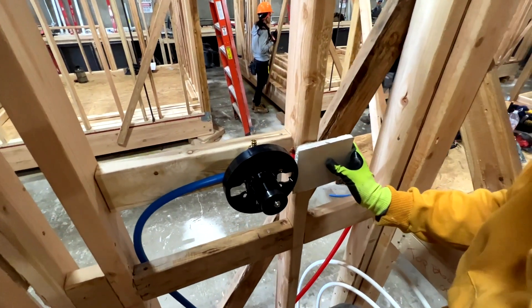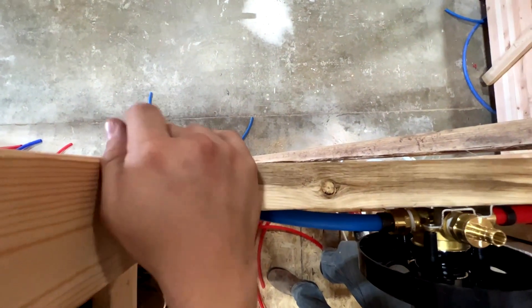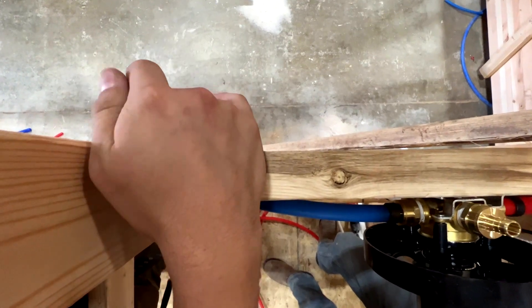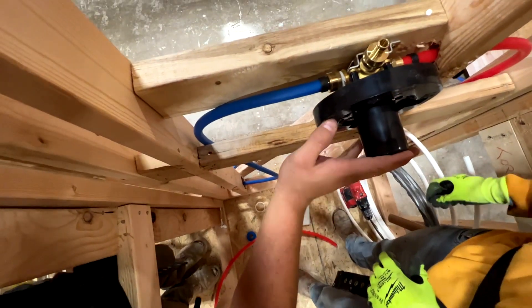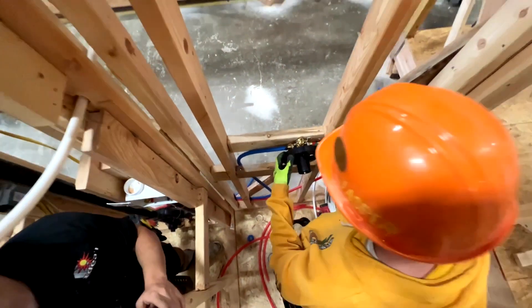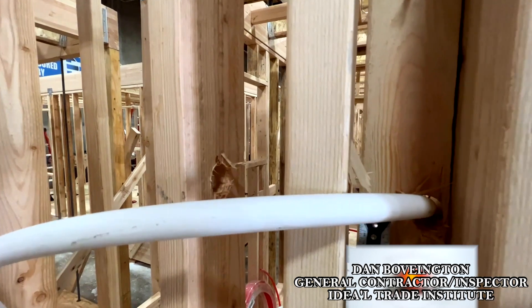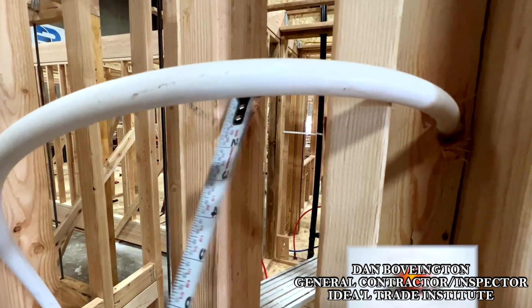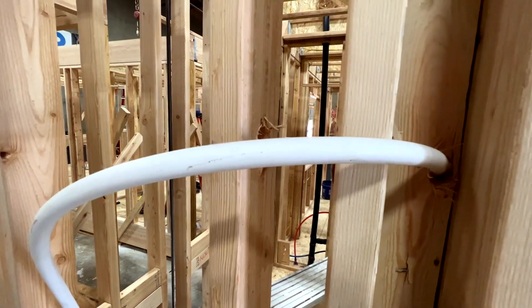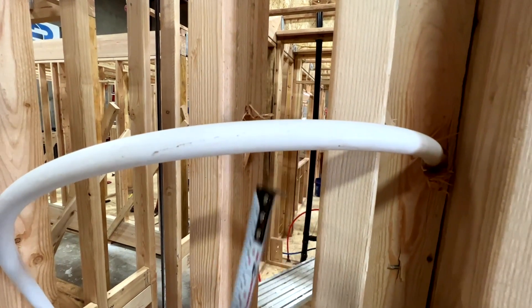When we put this block in, instead of being flush with the back you need to move it up about an eighth of an inch for good valve placement. You can either notch the stud to get the pipe through the hole or force it through. Notching means cutting the wood out in front of the hole and then putting a nail plate over the surface so you don't drive a nail into the pipe.